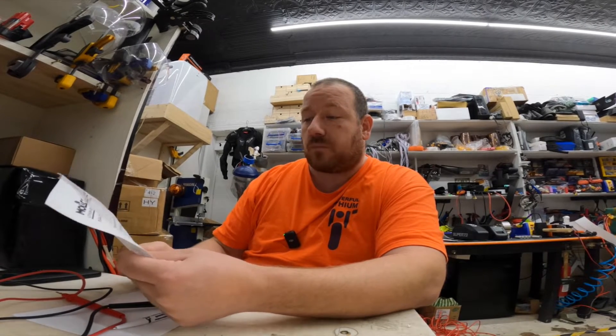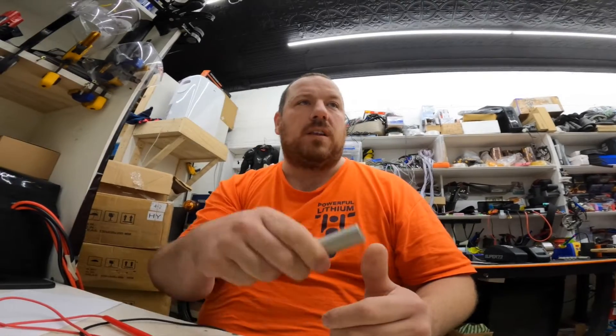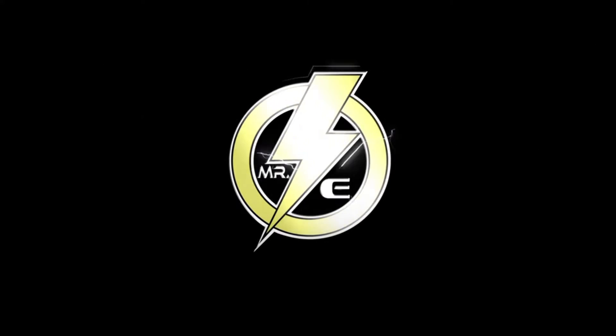Internal resistance for DC cells is 16 milliohms maximum. Bad cells usually means they don't have a good discharge rate — no matter if it's Molicel, Samsung, LG, or any brand. What's up guys and girls, in today's video we are not riding, we are taking a drive to visit the boys over at Powerful Lithium. We're talking about cells — where they get them and what kind they use — so let's get into this.